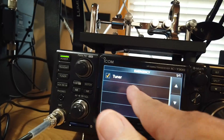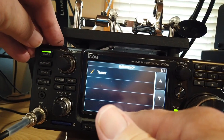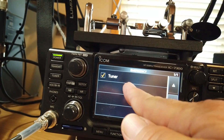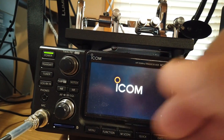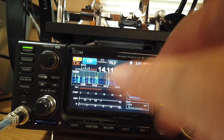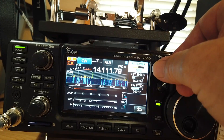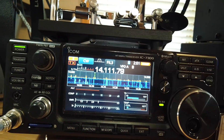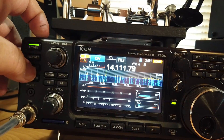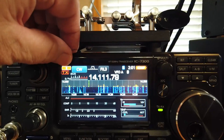Underneath is a blinking light that says "restart to set." Now I thought, oh, I just power cycle it here — no, that's not what you do. You have to press right on this button. It comes back up in emergency tune mode. We check the RF power: 50%. Now let's put it into tuner mode, and it's got the E right up here indicating emergency mode.